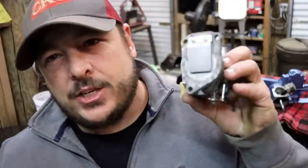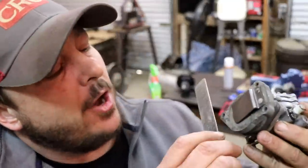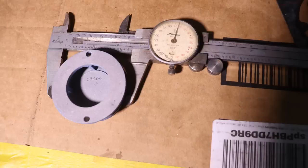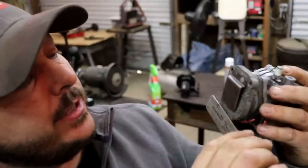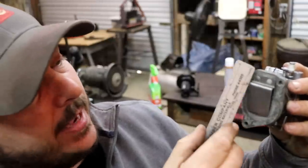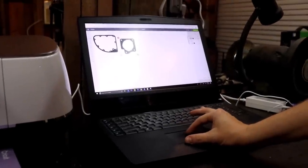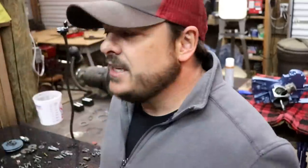It's a pretty easy setup. What you have to do is make sure you have the correct measurements. You take your small ruler, snap a photo with a reference point — someplace you know — a known distance. You get the entire height in a photo, throw it in Photoshop, mask it, and then transfer that over to the maker program. The maker program has a function that lets you set your measurements, throw it to the printer, load your material, send the command to the cutter, and it cuts out your gaskets.